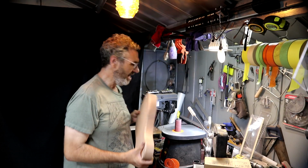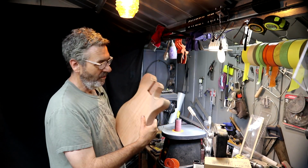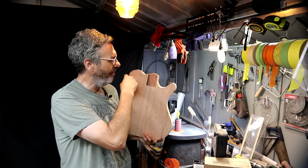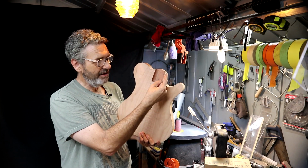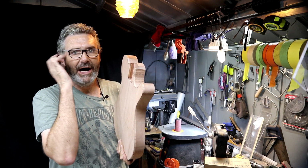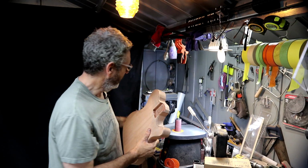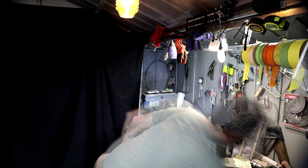decision. I've changed over to a 2-inch drum from the 2.5-inch. We're gonna catch the cutaway and this upper little bow part right here, and I'm gonna work on this shape just a little. Then we'll take a chisel and pare this away. That meat that's left right there on the side of the neck pocket, I did not want to run into that with the bandsaw. So we'll get that out manually. Let's get this finished up.